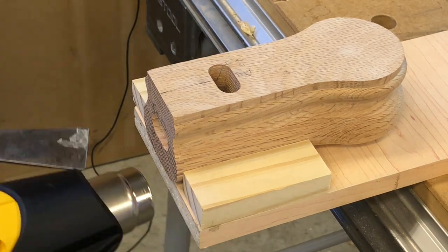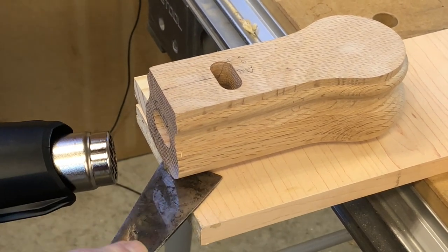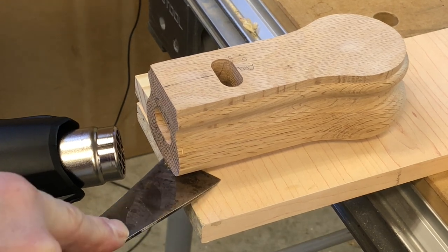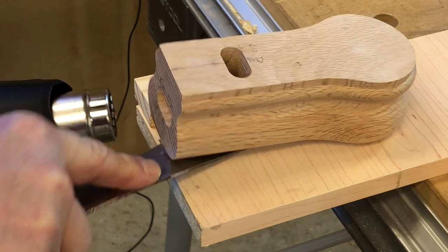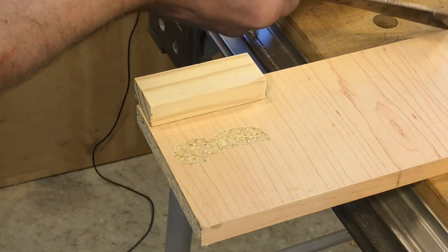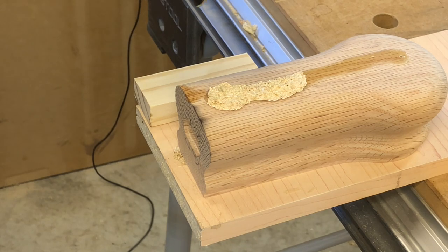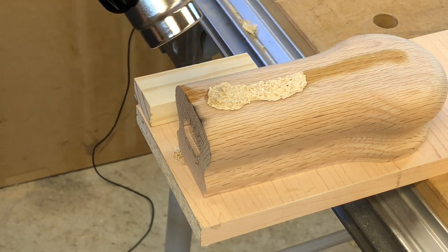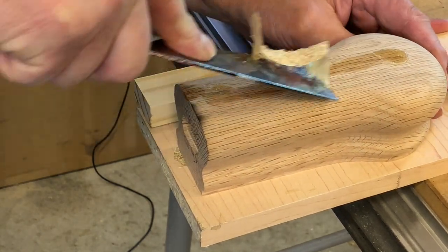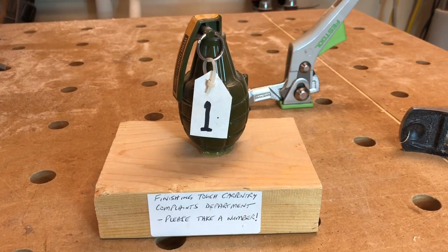Now that all the domino work is done, it's a matter of prying the fittings off the plywood. It looks like I'm a rookie at using a heat gun because I used a little bit too much heat trying to remove this fitting — so maybe don't do that when you do yours. I burnt the wood a little bit, but a bit of work with a sander and it's as good as new. I do make mistakes and I try to fix them as best I can.